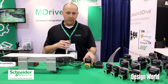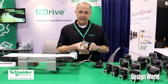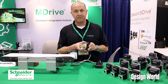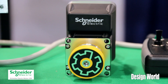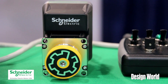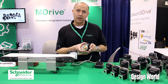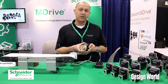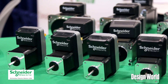What we've done with LMD is we have HMT technology, which in essence delivers closed-loop, servo-like performance. Typically with servos, they do it using DSP and control algorithms that you set tuning gains on to get your closed-loop performance. What we do with LMD is we actually close the loop right on the hardware — on the chip itself — which gives us 50 nanosecond update rates.